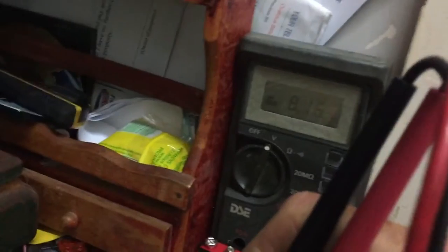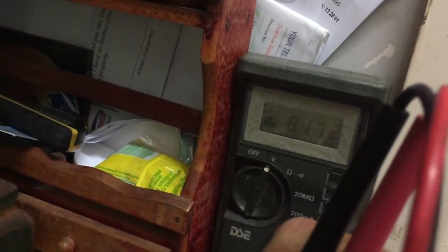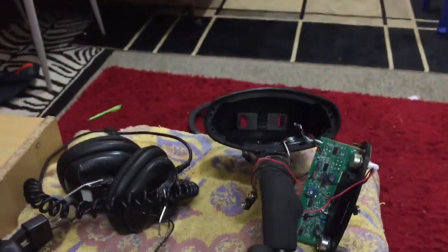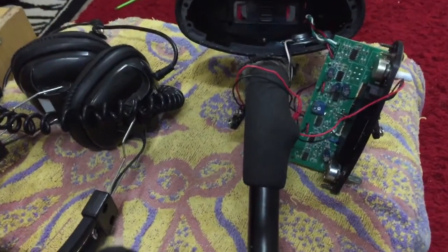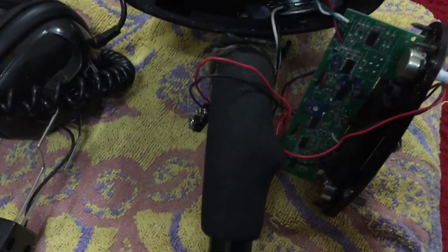This is what I thought it was going to be anyway. I had good batteries in there, but when I went down there was chirping and they're only coming up as like 8 volts. I'd like to say it's around 9.3 to 9.7 volts — that'd be good — but yeah, that's no good. That's probably the biggest reason why it was chirping. Problem solved on why she was chirping.